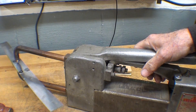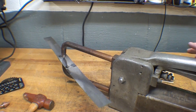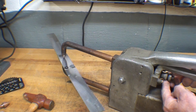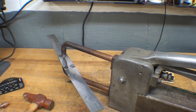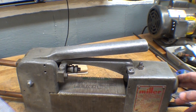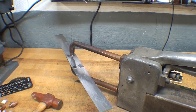You don't want too much pressure. If you have too much pressure you're literally going to blow the metal apart as the weld proceeds and the metal turns red hot. The pressure can then be locked with a double nut. At the high school level I would normally preset this for the kids so they didn't destroy their work — sometimes they'd be working on a sheet metal project and ruin it by having this set too high and blow a hole through it. They would also love to sabotage others' work by setting it real high, so you had to watch for that as a shop teacher.